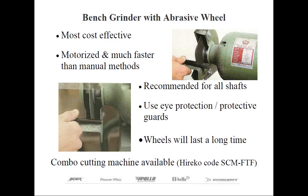One of the best methods of cutting shafts for small and medium-sized shops is the use of an abrasive metal cutting wheel attached to a bench grinder. It's recommended to use a 3,450 RPM, minimum one-third horsepower grinder. This ensures quality of cut with the abrasive cutoff wheel, producing a smooth and clean cut. When selecting an abrasive wheel, choose one rated for ferrous metal cutting, as it's designed to last longer with any type of shaft material. Use very little force, since the grit of the wheel supplies all the cutting action. Abrasive wheels can cut all types of shafts — from steel to titanium to fiberglass and composites.